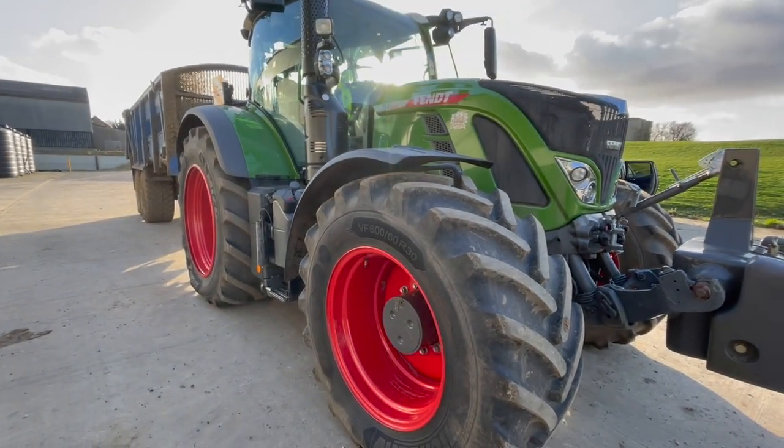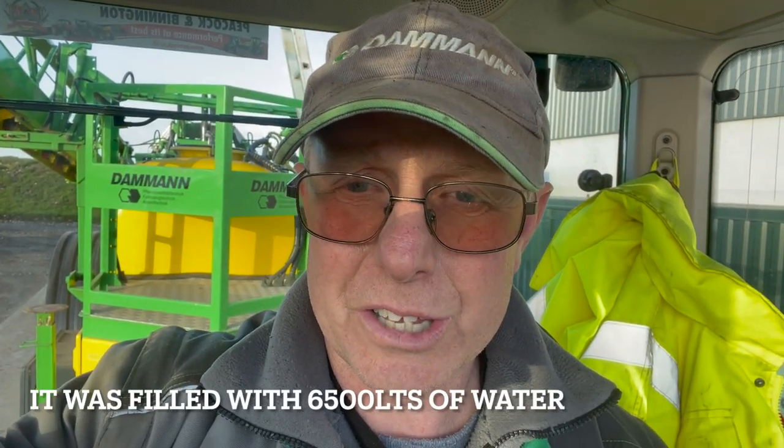We've had a swap over now — we've got the sprayer on. This is what I'm interested in: seeing what we can let the tyres down to, because I've been running them at 12 psi. We weighed the sprayer and it was lighter than the trailer. The end result was: if I run the sprayer at full capacity I can lower the tyre pressure down to 9 psi in the rear and 9 psi in the front, but that's a maximum of 30 km/h on the road. To be honest, don't go flat out at full tank — it's very rare I have a completely full tank anyway. So that's good news — running at 9 psi should create fewer ruts.